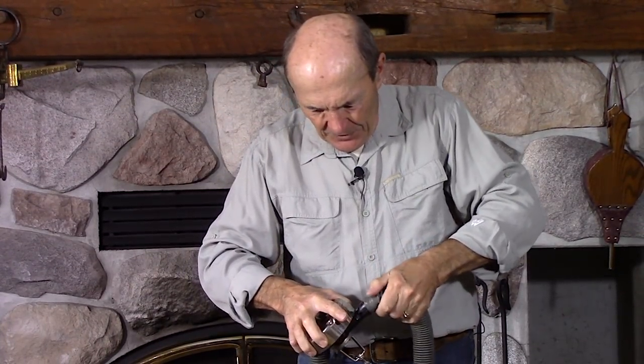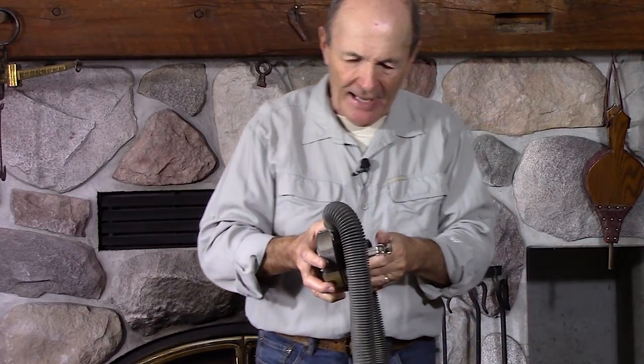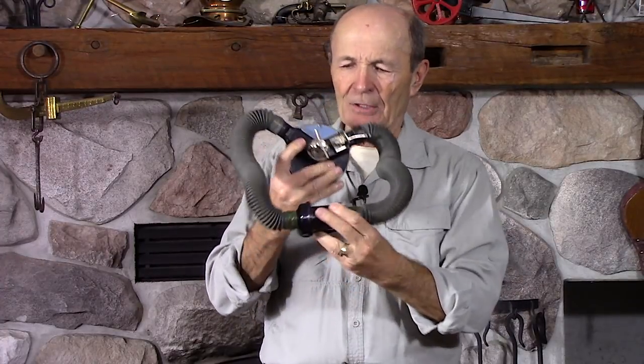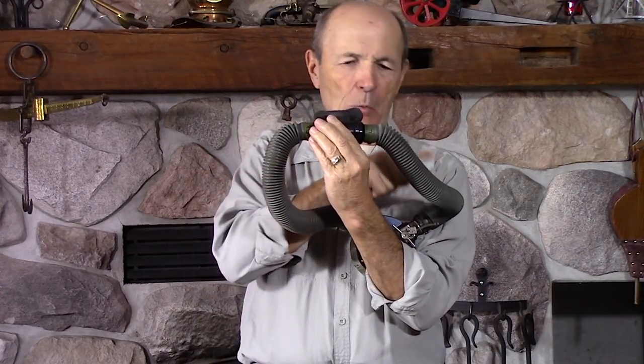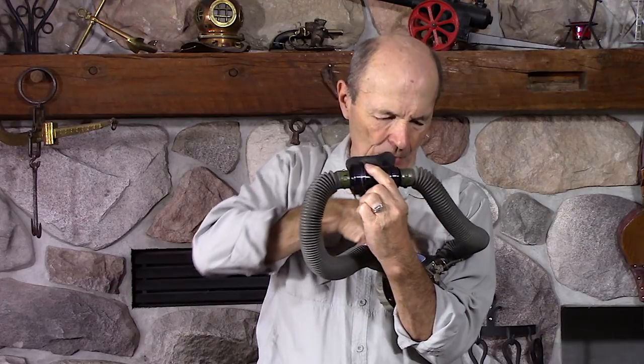This regulator is very old — 1954. It's an old plastic-bodied Dive Air, which came in three versions: plastic, aluminum, and bronze. Anyway, this sits on the back, and this goes into your mouth. With this Hope-Page mouthpiece, you suck and get air coming in past the one-way flapper valve into your mouth. The flapper valve on the exhale side won't let water come in — you can only suck air, not water. When you exhale, that intake flapper closes and the exhale flapper opens, letting air bubble up behind your head.